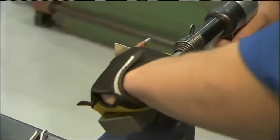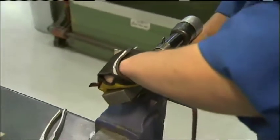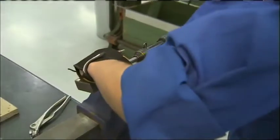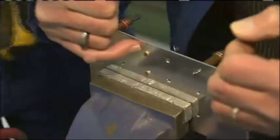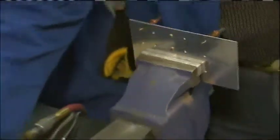This is a fine science because everything has to be uniform. Yes, and this comes with feeling. All of these rivets have to be the same diameter when they're done. The holes are three thousandths of an inch bigger, so when you drive them, it expands the holes. So we're going to let you try this.